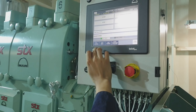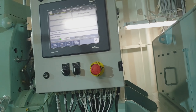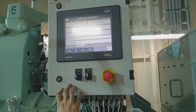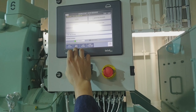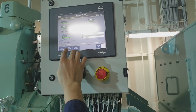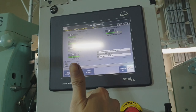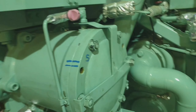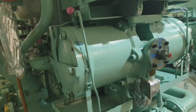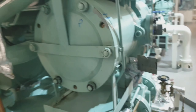We will start the engine and check the differential pressure between the filter inlet and the engine inlet lube oil pressure. It is confirmed that we have a good result — the engine inlet and the filter inlet pressures are almost the same. Until here, I hope you learned something from this video. If you like it, please don't forget to hit like, share, and subscribe. This is JB23vlog — thank you for watching, stay safe everyone, bye bye.